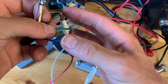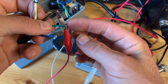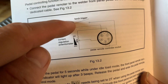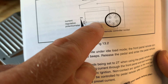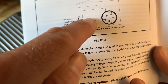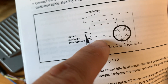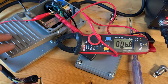Those two are the maximum and the lowest, so we have to solder the green one as the middle. If I measure on the max and the minus and press the pedal, it doesn't do anything. If I measure the green one and this one, it goes from max to low. And the green and the blue goes from low to max. So that's how we're going to solder it — pin number four is green, from zero to more.